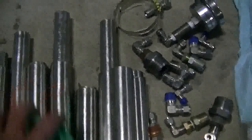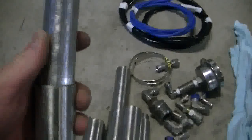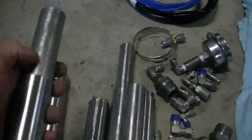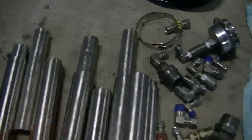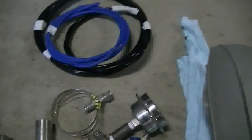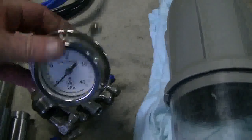This is our cell - it's ready to be assembled. As you can see I've cut these out to hold our tubes - our inner and outer tubes - all being sanded in a cross hatch pattern. This helps the bubbles to fall off of the pipes instead of stick. We have all our fittings - all high pressure stainless steel fittings. We have our two different size high pressure hoses, our flow meter which will be telling us how much we're getting through the system, and also our pressure gauge which will be going on the system.